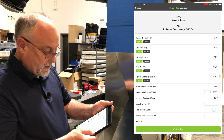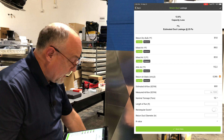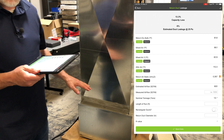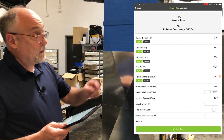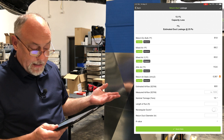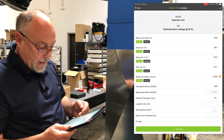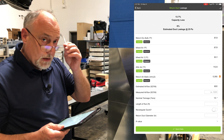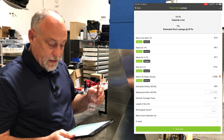Return air dry bulb is 81 degrees, the mixed air temperature is 87.9, and mixed air 2 is 82. Even clear down at the bottom in the filter, after the air goes through the filter and sort of crashes at the bottom, there's still quite a bit of difference — a six-degree difference between them. Our attic air is at 112 degrees, which is not that hot for a typical attic. Return air static is at 0.25, and estimated airflow is at 600 CFM. So you can use MeasureQuick and a couple of probes to quickly estimate capacity loss and estimated duct leakage.